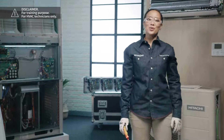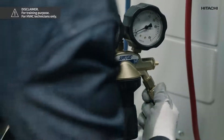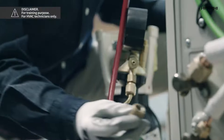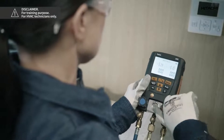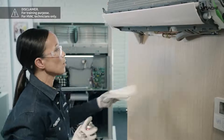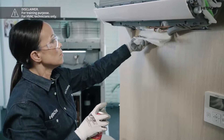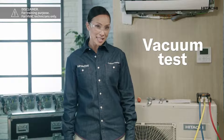When we have finished we will check that our circuit is totally leak tight. To do this we will perform the leak and vacuum test to check that there are no leaks. To carry out the leak test we are going to introduce nitrogen into the system. It is essential that we use a pressure regulator to reduce the pressure we want to introduce to our circuit. So we connect the pressure gauge to the nitrogen bottle and the manifold gauge. We regulate the pressure to 41.5 kilos on the pressure regulator so that no more pressure is introduced into the cooling system. Once we have adjusted the pressure regulator we open the manifold gauge and allow the nitrogen to enter our unit. When the pressure stabilizes we close the manifold gauge and proceed to check for leaks using a soapy leak detector. As we can see we have no leaks in the indoor unit nor the outdoor unit.